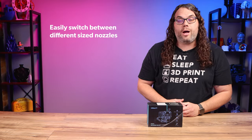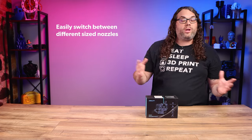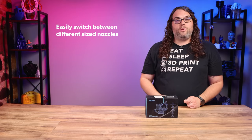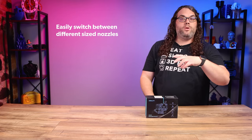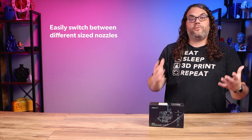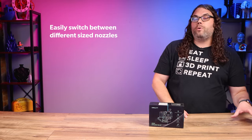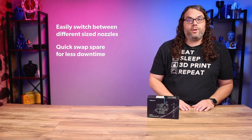Why would you need to swap it? You can do this if you want a couple of different hot ends with different nozzle sizes and you just want to swap them quickly between prints. Say you're printing with a 0.4 and the next print you want to use a 0.8 nozzle — all you have to do is remove the bolts, drop the new one on, put the bolts back in, and rock and roll. You can also have an extra one around in case the nozzle jams or fails, toss the new one on, and fix the old one while the printer continues to print. This allows for less downtime on your printer.